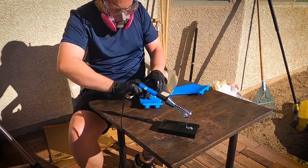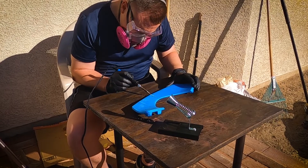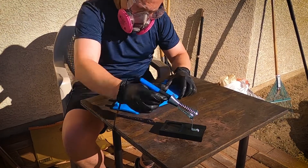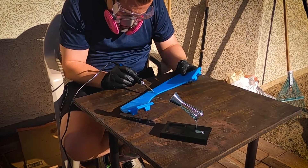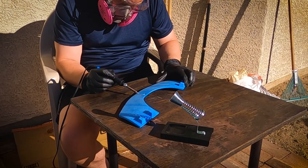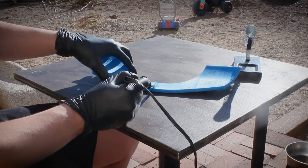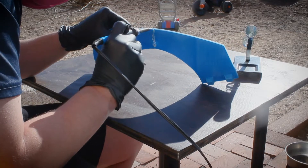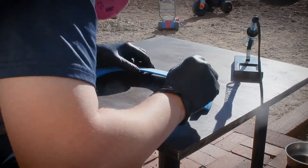The next day when I knew all my glue was set I took my pieces outside to do some soldering on them — this is how we do our plastic weld. If you take an old soldering iron and dig it in between the seams of two different plastic pieces you can re-melt the plastic, just like welding two pieces of metal together. I went through the seams to make sure they were relatively melted, then dug out further past the seams and scraped towards them to build up the material a little bit.